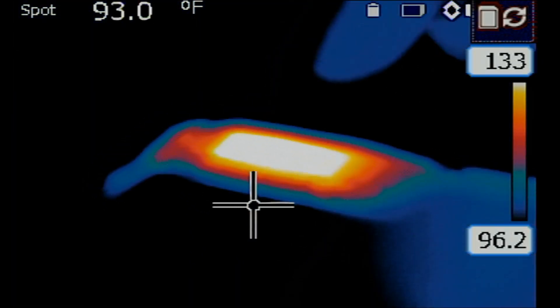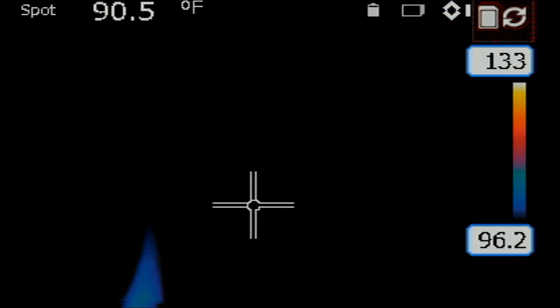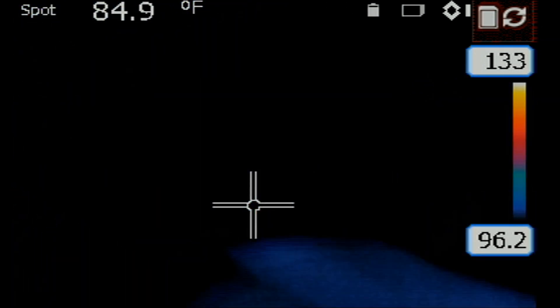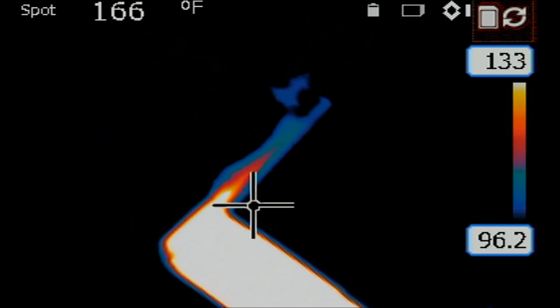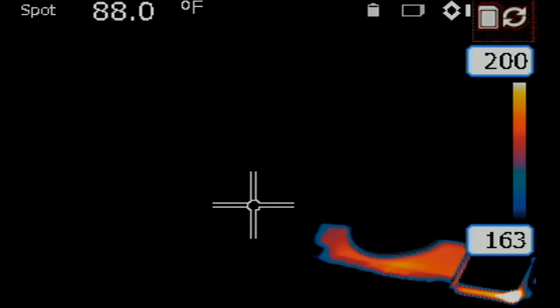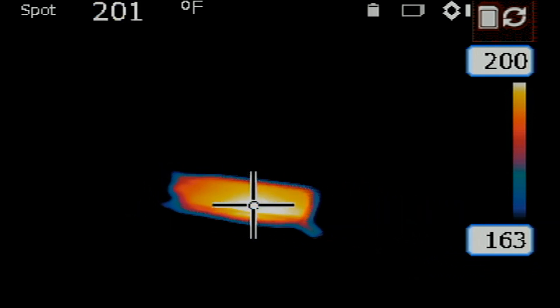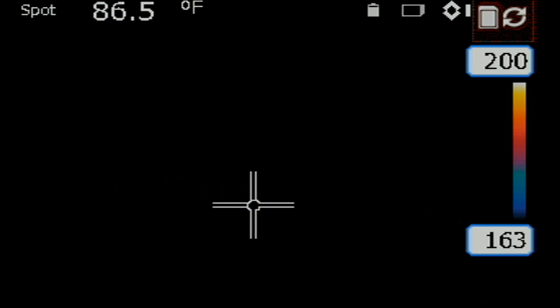Right there — very hot. And what happens if we flip the board? I cannot even touch the board, it's super hot. We see heat on the back as well — a lot of heat. 179, 180, 184 degrees. Wow. So the problem is possibly coming from here or from the back of the board — either this side, back of the board, or front of the board. Look at the temperature: 205 degrees Fahrenheit. Let me disconnect.